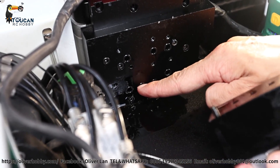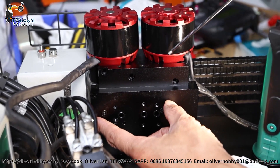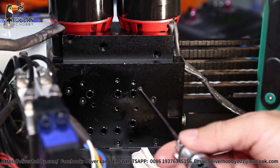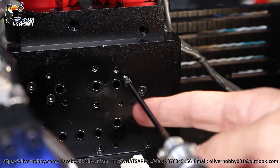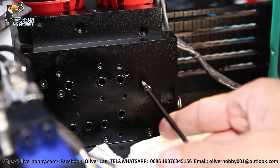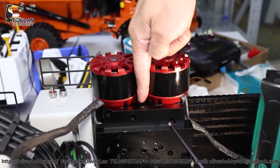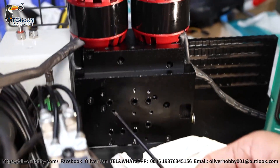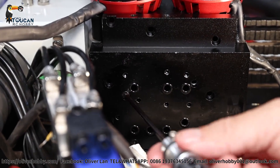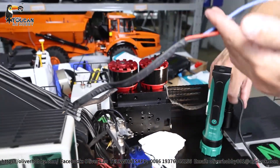Now we are coming to the middle main connection CNC alloy block for the valve block and pump block connection. The pump is secured to this block by two screws on the rear side for the big arm pump. This screw is a special round one because it's near the oil channel. Remove and take out both. The rear side pump is secured with these, together with the motor-pump connection block. Two pumps need to be removed at the same time. The forward pump is secured by these two screws — take them out. Then all wires, already removed, were connecting here via quick connection.